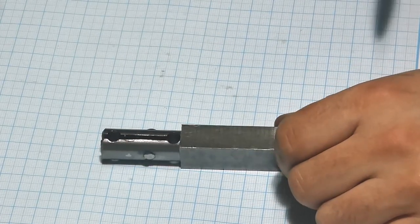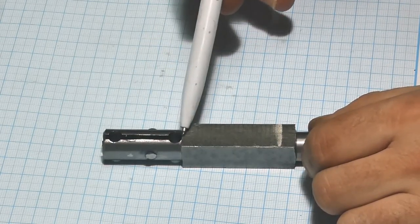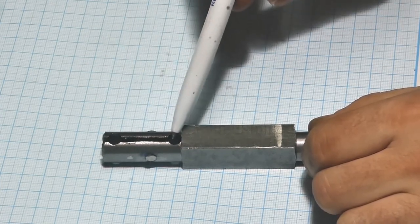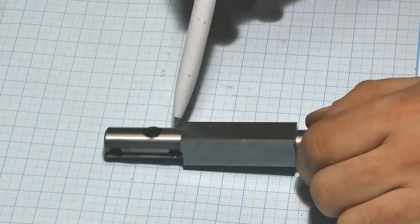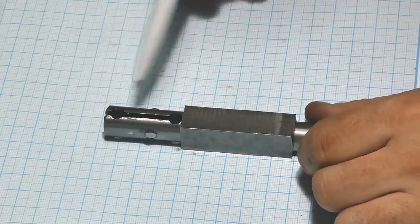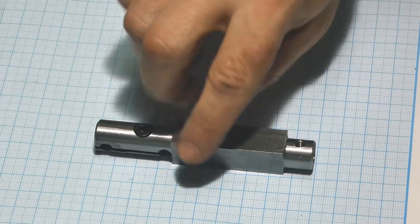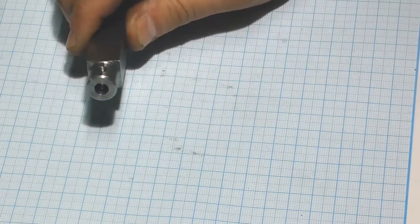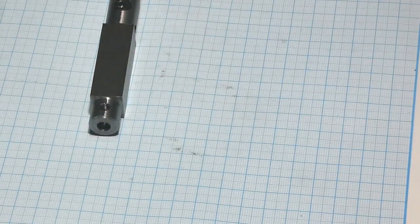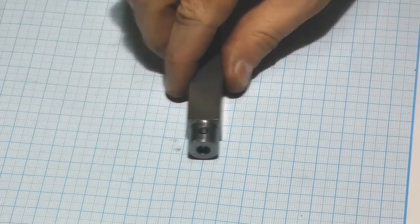it's made in this manner. It is slitted in the middle. We have the hole for the 6 millimeter bit. We have this hole that helps flexing it for the screw that tightens the bit in here. And one interesting thing about this is that I made a hole from the other side also for the set screw, where you can use it as an external threading.